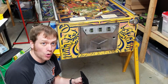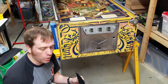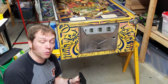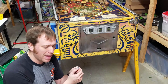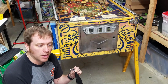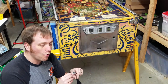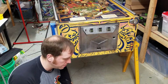Now, sometimes I don't use an impact drill to put legs on, especially if I'm working with legs that have been powder coated or epoxy painted, or bolts that have the heads powder coated or epoxy painted. So a really interesting top tip is that if you have bolts that you want to protect from paint or powder coating, you go a size up to 5/8 on your socket, and then stick a microfiber cloth inside the socket. That will fit over the bolt, and then you'll be able to tighten it. But today, we don't have to worry about that. So let's get our first leg connected.